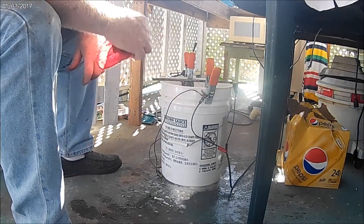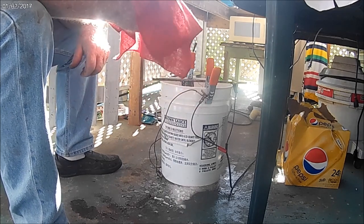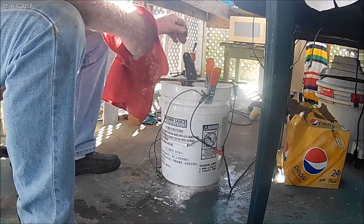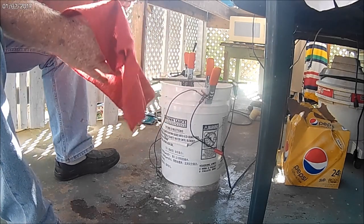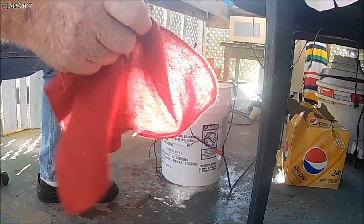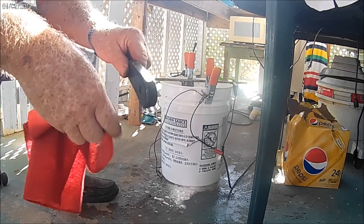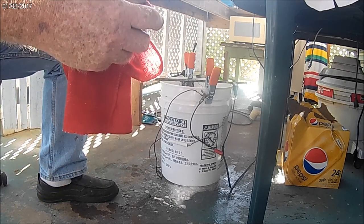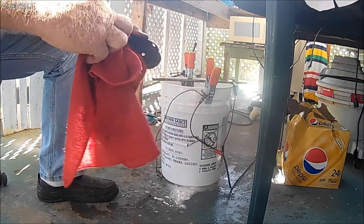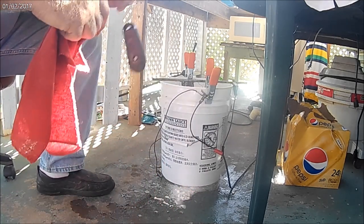The electrolysis tank has been running — I think it was 11:30 when I started and it's 5:30 now, so it's been a while. Naturally it's going to have some color to it, but most of that rust is gone. I'm going to leave this old butt plate in there longer because it was really bad, and inside here is pretty bad too, so it needs a little more treatment than that.